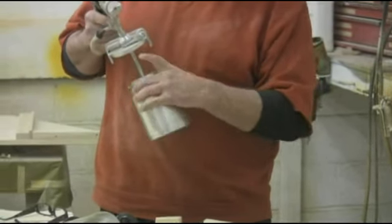Now, the paint I'm using is General Finishes Antique White Milk Paint. Now, you can brush this stuff just wonderfully. It does great. And I tell you what, use a good synthetic, because it's water, or use one of your painting pads or a foam brush. It does a nice job. But any good latex paint or water-based paint will do.